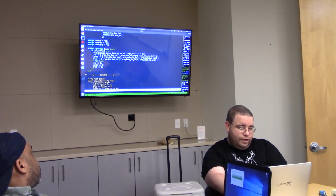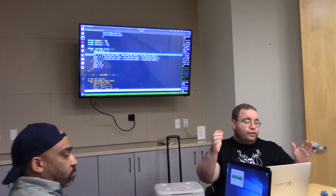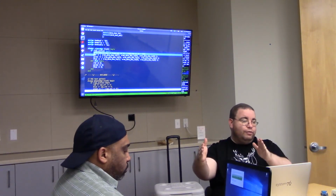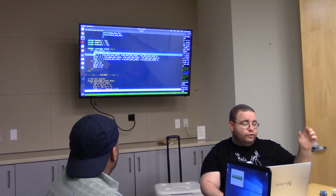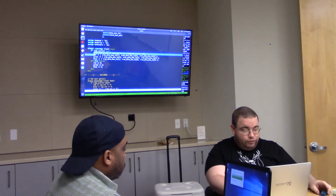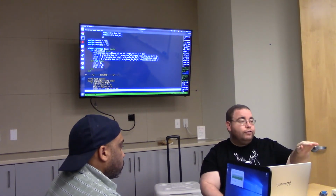So right here, what I'm doing is giving the VRAM address bus a new value for this clock: the column shifted over by 1 plus the row shifted over by 1 times 320. So I'm just counting left to right, top to bottom pixels, starting at 0. And I'm using this little arrow equals thing, which is going to load a register.